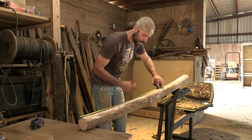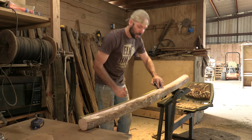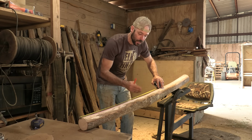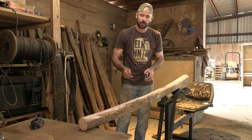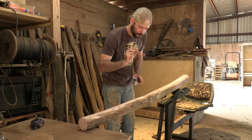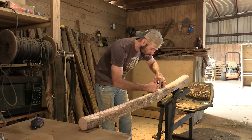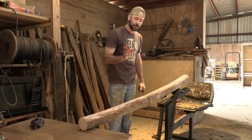We're going to go up 2 inches and down 2 inches, and that is going to be our handle section. Now out from that, we're going to come out another, say, 2 inches or so. Doesn't matter, you can go 3 inches, and this is going to be your fades, the area where your narrow handle flares out into the full width of your limbs, and also the depth of your handle kind of fades down into the final thickness of the limbs. So we're going to go up 2 inches from that, down 2 inches, 2, 4, 6, 8. So we're going to have an 8-inch stiff riser section in this bow.